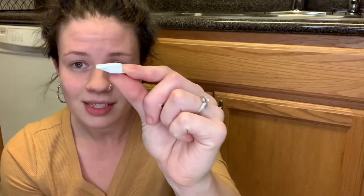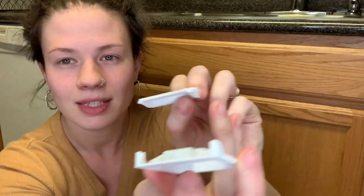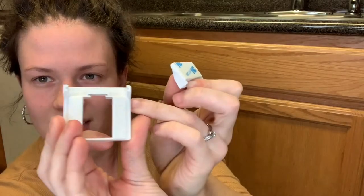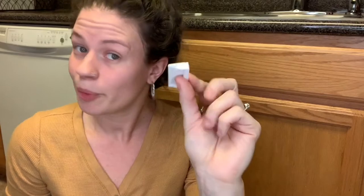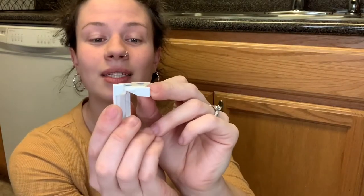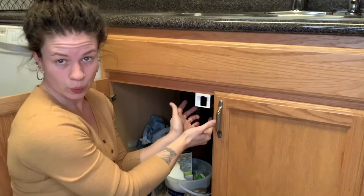Here's where it all gets way easier than last time. One of the new installation tools Eco Baby provides is their cradle. Imagine this is my strike plate that I just installed in my cabinet — you can see there are little fins on the side that will fit into this cradle. So with my strike plate already in place, I'm going to take my cradle, flat side out, and slip it onto my strike plate.